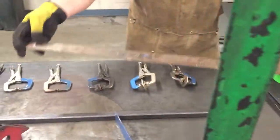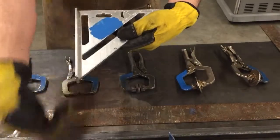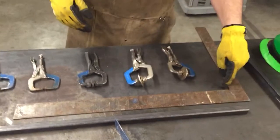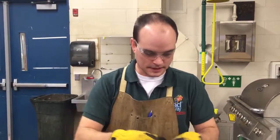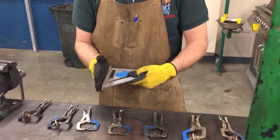And I just want to point out that when you're using one of these, yes, this would work. However, the longer these are, the more accurate that 90 degree inside corner is going to be. So if you're making something, if you're pouring concrete, let's say, the longer that triangle, that square, that 90 degree, the more accurate that is going to be. If I'm squaring up a building to this, I have a lot of deflection that can happen, and I can get a lot of error. So it's always good to double check.